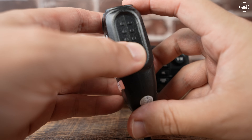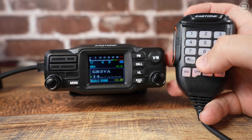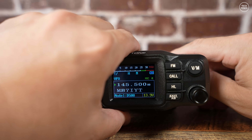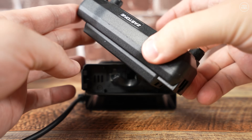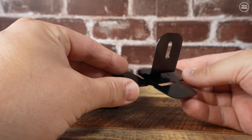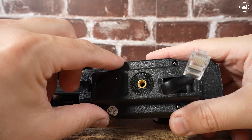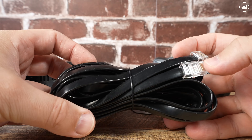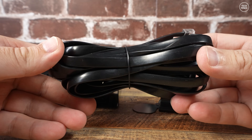You can completely control the radio from the microphone, including accessing the menu, changing VFOs, changing power level, and direct dialing of frequency. Removing the head unit is quite easy — there's just one push clip on the right side behind the display. In the box you get a main unit bracket for mounting, alongside a mount specifically for the head unit, which attaches with just one thumb screw on the rear. You also get five meters of control cable included in the box that connects the main unit and the head unit, so there are no expensive extras just to remote mount the head away from the radio.